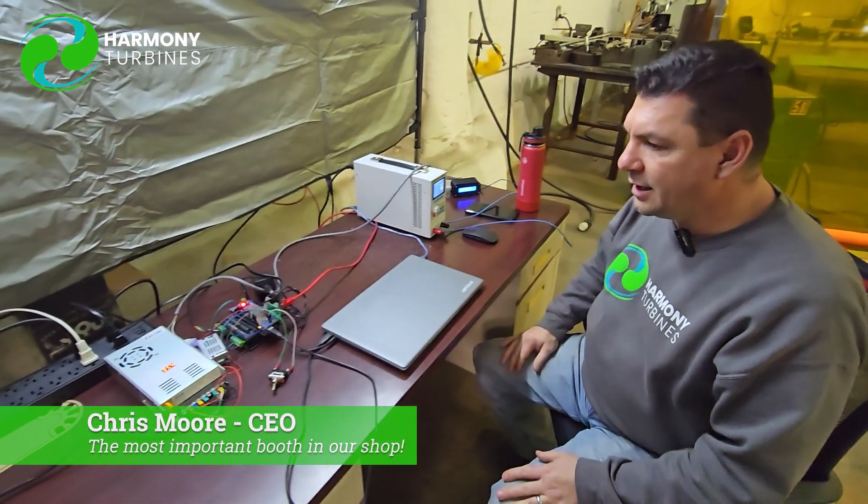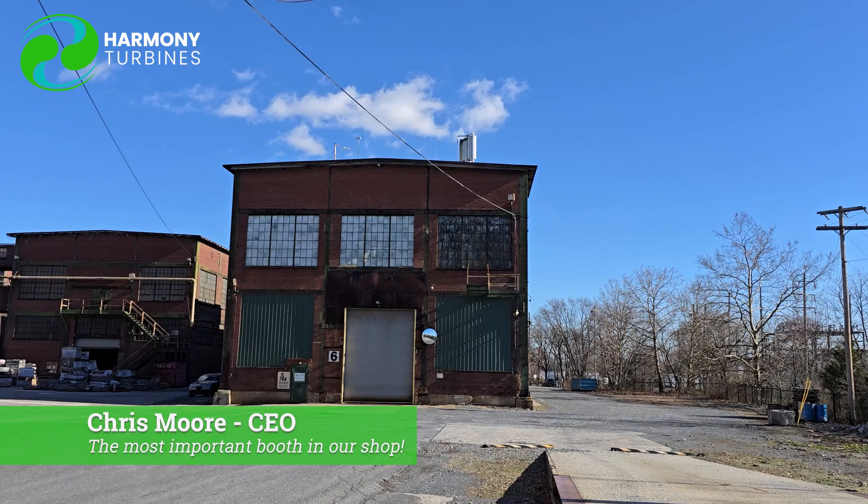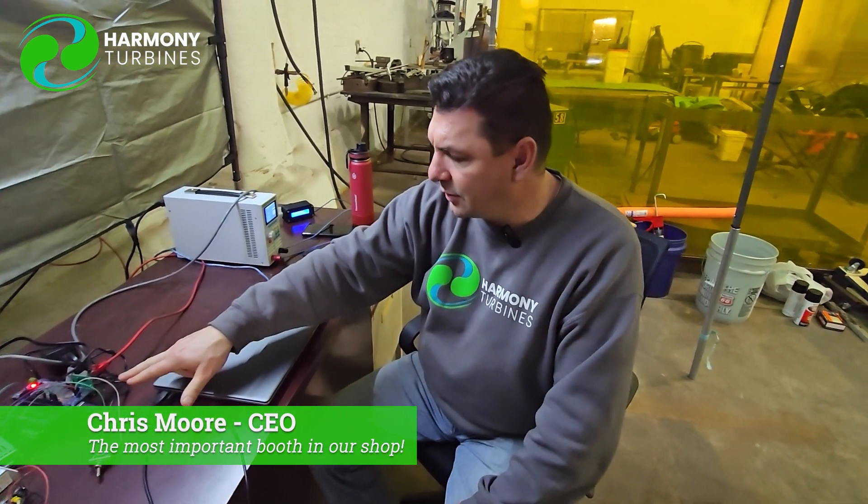At any rate, this is the really important little data collection center — the heart and soul of our data collection. We'd be able to have multiple units all gathering to the same database, so as we get more units up on the roof we'll bring the wires down through our candy cane and hook them in here. Right now we have one unit on the roof. A second unit would have its own load cell, driver, and Arduino board, but the power supply could easily supply multiple turbines since 99.9% of the time they're not needing to furl.